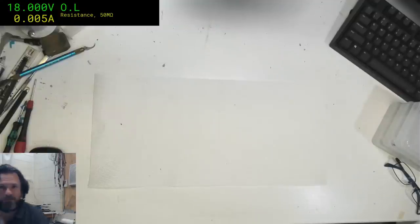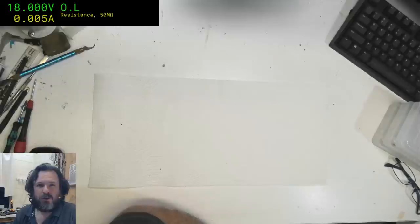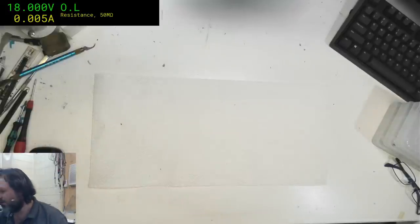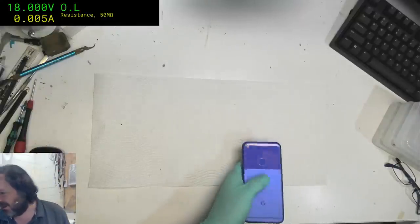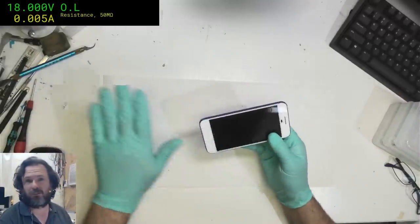And we've had some bad news. That 820163 board, the one that we had to battle around with, and we found it to be the battery that needed replacing, amongst other things. I got that out of the ultrasonic cleaner today, and it three beeped at me, and that's it. Dead. I'm not going to bother trying fixing that because more than likely three beeps on those things, it's PCH or something like that. It's just a rabbit hole. I've got to walk away from that one. I can get the data. It's not a major problem. Alright. Oh, and the 1425 still hasn't come back. That's completely dead.